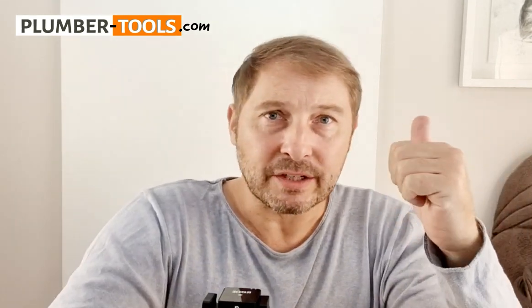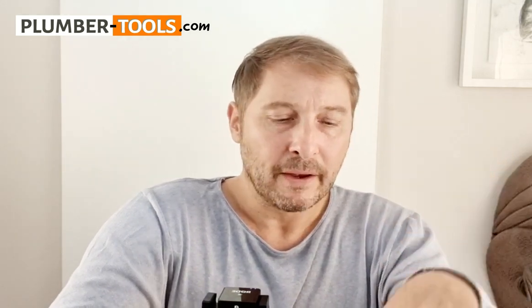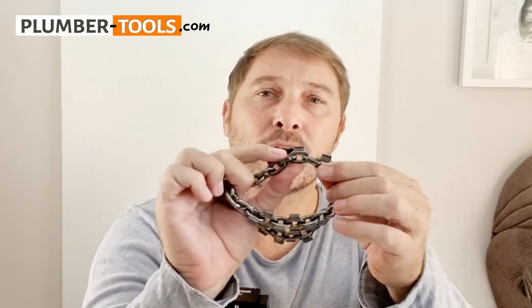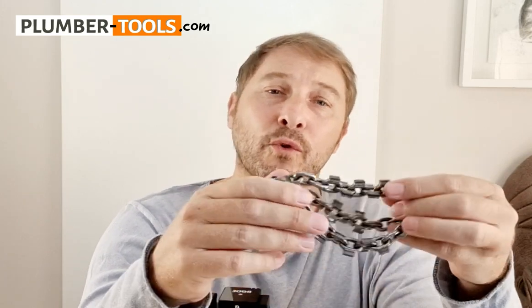I have a question from Tyrone in South Africa. Tyrone asks, what is the difference between a circular chain and the other chains? A circular chain is used for descaling, whilst the other chains are used for removing obstructions. I do know that clients are also using the circular chain for removing obstructions, putting the chain further back on the shaft and adding a drill head to the front. Circular chains come in two types: one without hard metal bits for PVC, and one with hard metal bits for cast iron. Your regular chains also come with or without hard metal bits, again for PVC or cast iron pipes.